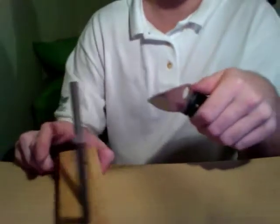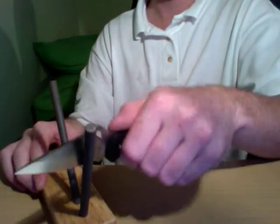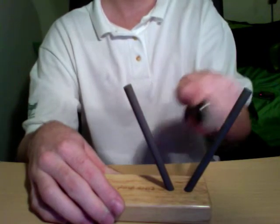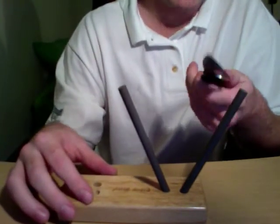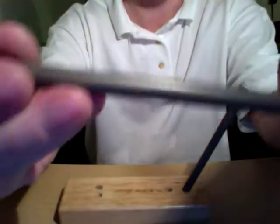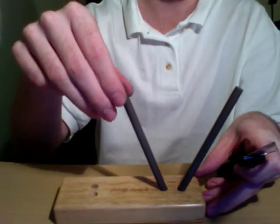Not the most exciting thing in the world, obviously. I'll just show you from a side view, kind of what it looks like — nice and slow. You can see it come down from the end and slide all the way down. After quite a few passes there, just wipe off the tip a little bit. You'll see you're going to get some grit residue. You can see on the rod itself where it shines — that's the metal coming off onto the rod. You can clean these with some hand soap and hot water to get all that excess metal off the rods.